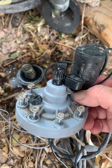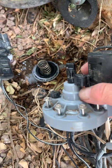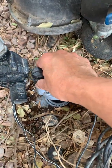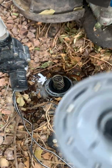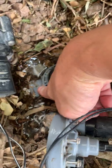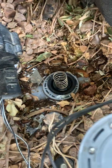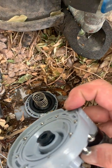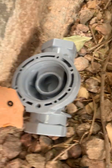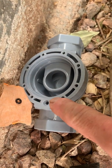This is what the top of the valve looks like. This is an older version — the newer version has a handle for the flow adjustment rate control or shutoff control. It's going to end up sitting like that with the solenoid in the supply side, and there's a tiny little nipple here that projects into an indexing hole at the base of the valve. The other eight holes are for the screws, and one trick is that there is a little o-ring that needs to go on that nipple — I only found that online and I happened to buy another body to get all the replacement parts. Here's the o-ring that comes out of that body.